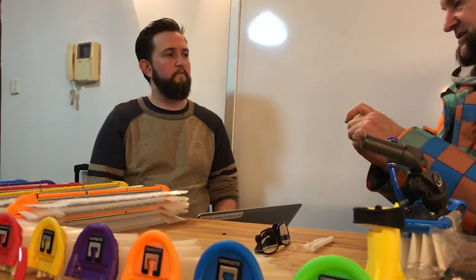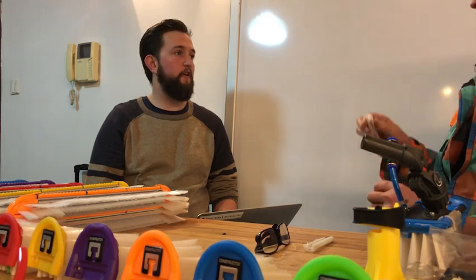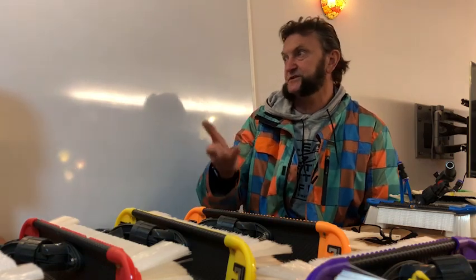So to balance that, the operator can actually say, okay, on site, I've got too many jets open. I need to reduce that because there's not enough water coming out of the jets. There's not enough velocity. The water might be enough, but there's not enough velocity.